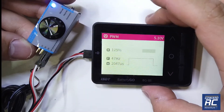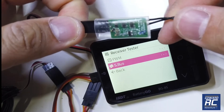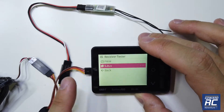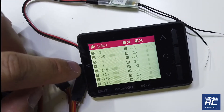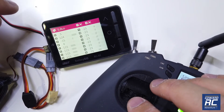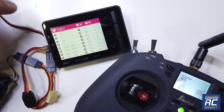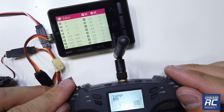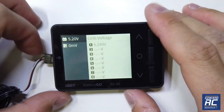Now for the S-bus signal test — this is my favorite feature. My FrSky XM+ receiver is kind of unreliable and tends to go bad, so I have it connected with a white cable to supply 5 volts to the tester. Press S-bus, bind your receiver, and the channel values appear. For pitch, which is the second channel, I get a range of 0 to 120 or negative 120, and at midpoint it reads close to zero. I have all eight channels set up on the receiver and channels 5 through 8 work as well.